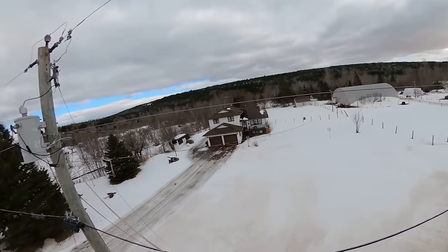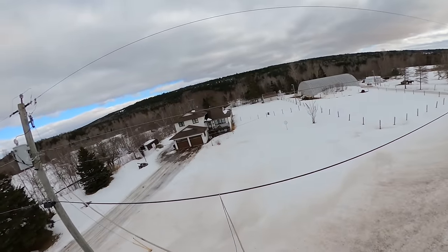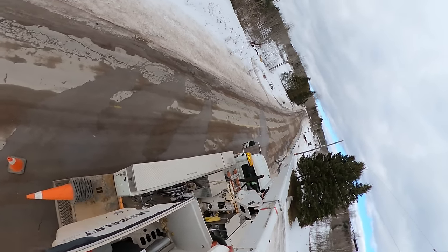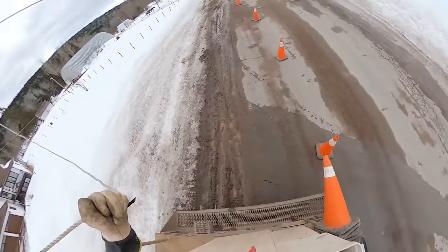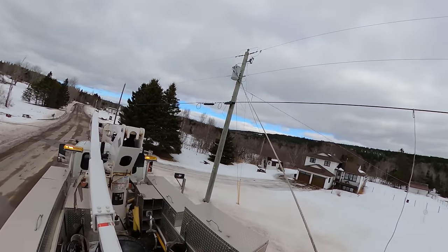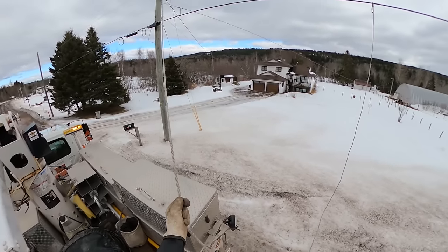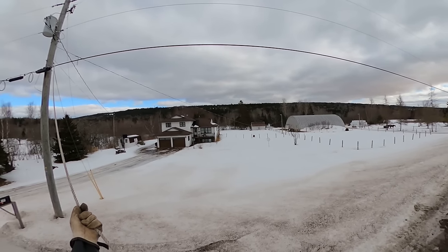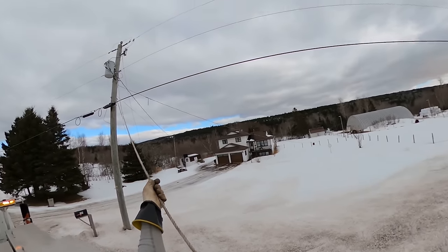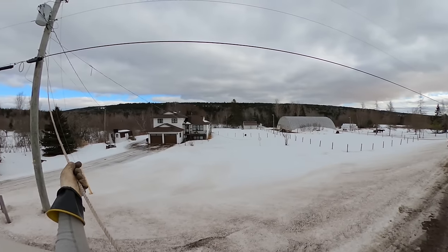It's important to keep an eye on things as we go. Instead of lowering it down, I'm going to hold the line at full tension until I'm all the way seated in the cradle. I should have put my hand on the other side of that telephone - not a big deal. The reason I've got my rope configured this way is just so I can retrieve it without having to go back up the pole. Now I'm lowering that duplex down - it's only about seven feet off the ground.